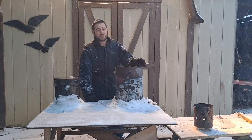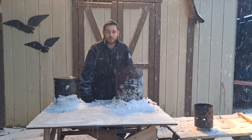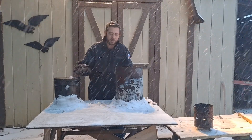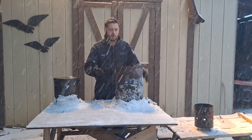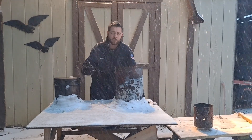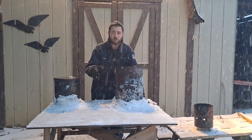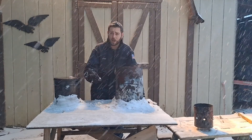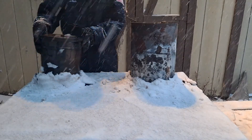It's been about four hours since we started the barrel. It started snowing like crazy so I went ahead and took the cans off — they look mostly cooled. One was still glowing a little red on top because the lid wasn't completely sealed, so I tipped it upside down to deprive it of oxygen. Remember: if it's glowing red, it's getting too much oxygen and the charcoal will burn up. You want to completely deprive it of oxygen. These should be done, so I'm getting ready to open them up.